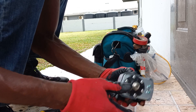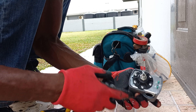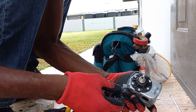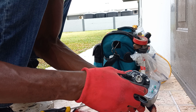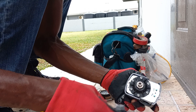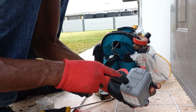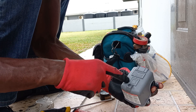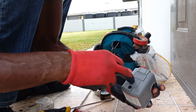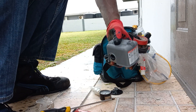And that's it — from male to female, and I screw it up. This might even save you a dollar and also time, because you might decide to go to the hardware store when you already have this. You save on time and gas, and sometimes these adapters are more expensive. They don't sell this part by itself. This works for the Square D brand — light duty and heavy duty — for the 20-40, 20-50, 40-60, whatever. That's it, folks. Over and out.